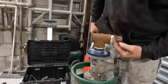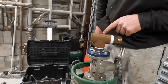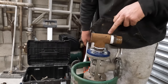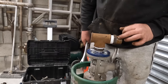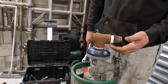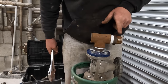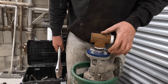This is going to wear, like I said. It would be better if it were not such a straight drop, and it'd be better if it were in stainless steel or a harder steel, something hard, because it's that bit that wears when the media is dropping and landing on there. It's the bottom of that, and then this will wear, so the threads on that side will go. That's your wear part. But if you think about it, you can do so many hours, so many tons of sand, and then work out how many times it burns through, and then you could just swap it round so that you took that to there and you put your air in that side and sand out this side, so you get maximum wear off it.